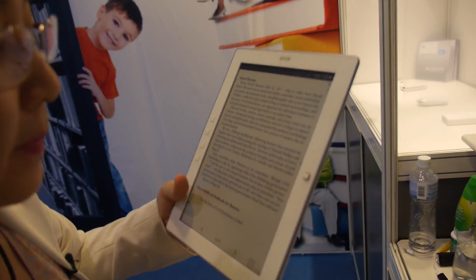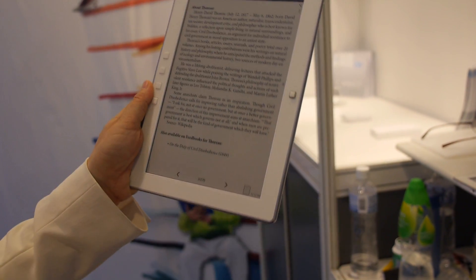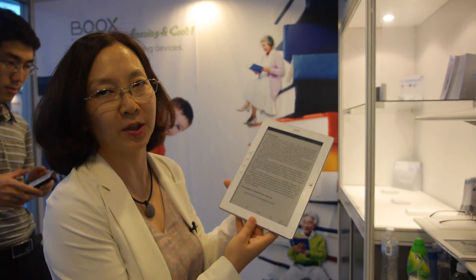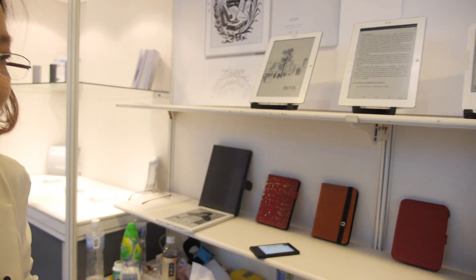You have Android 4.0 e-ink on a Freescale CPU. Is this still a prototype? No, it's real — it's for mass production. What's the advantage of using Freescale? Single-core Cortex-A9. Freescale is very professional in e-ink display support — they have the best performance and best power management. The new Cortex-A9 single core for e-reader is especially good because it offers more performance and better battery at the same time.